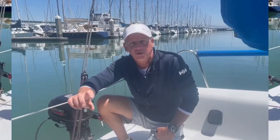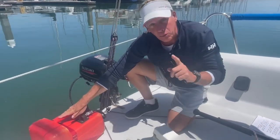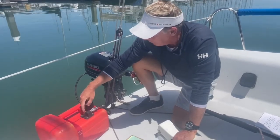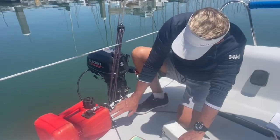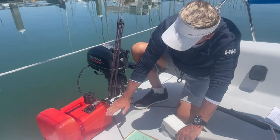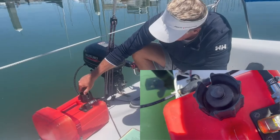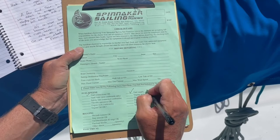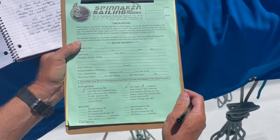Now let's check the fuel supply. This tank right here is a three-gallon tank, but even with one gallon in there, that should be plenty for a day of sailing. We can check the fuel level on the fuel gauge right here, and if the sun's shining just right, you can see the level of the fuel splashing about right there. The other thing we need is to have this vent open. I'm checking off the fuel line connection, I've written in the estimated amount of fuel — about three gallons — and have checked off that the air vent is open.